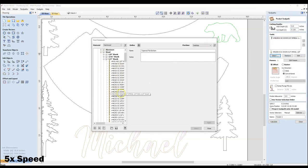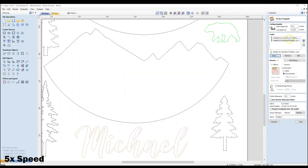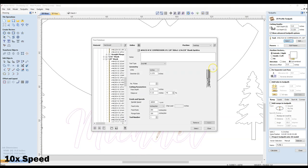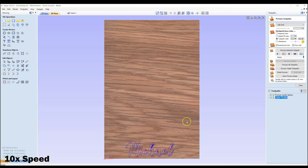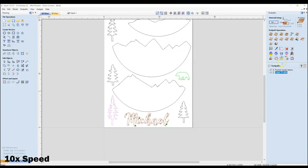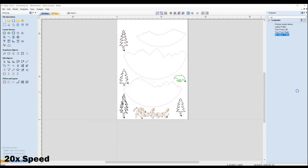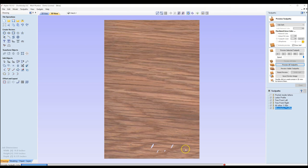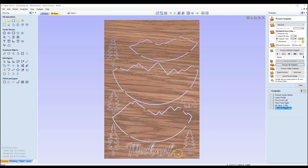I'm setting a pocket toolpath here with a 1/16th inch bit. We did just release a video talking about the Vectric tool files that are available on our website, so you can click right up there to see that. Because I film everything that I do, I set up the toolpaths individually to get different camera angles. The other larger pieces use the 46200-K eighth inch down cut bit, and I use some tabs to hold everything in place since they're a little bit larger. That design is now officially done so we can get started on the CNC tomorrow.